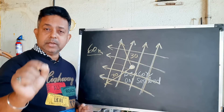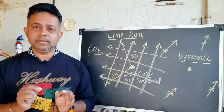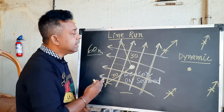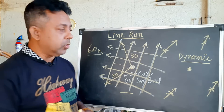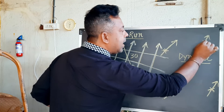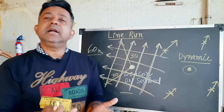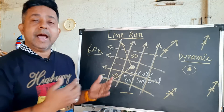To recap: whether you are on a DP vessel or a non-DP vessel, if you have diver or ROV support, you can run a line run method with four lines in each of two perpendicular directions around the beacon. If you are on a DP vessel with diver or ROV support, you can run a dynamic calibration — placing the beacon on the seabed, going to four cardinal points, maintaining a particular heading, and observing 150 to 200 sets of data at each point.